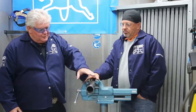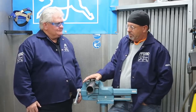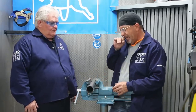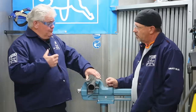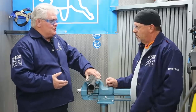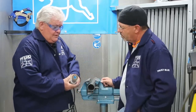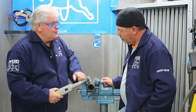What would be your conventional method? In my shop, I would probably chuck it up in a positioner and grab a flapper wheel, letting the thing turn. Or if it was stationary and I was doing this mobile, I'd dress this and rake the bevel with a flapper wheel. For the majority of viewers, the flap disc is going to be the most common item. Some people use a hand tool — takes a lot of time and effort. Another way is to come in with a flap drum, which fits inside the pipe and removes the inner burr and ridge very quickly.